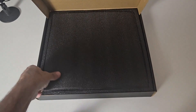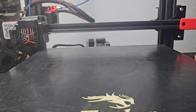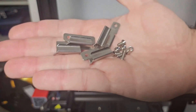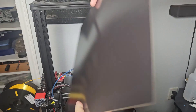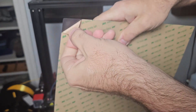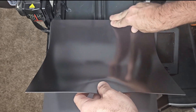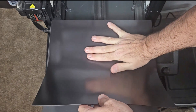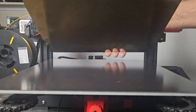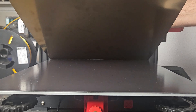This is how I installed mine on my Ender 3 Max Neo. Installation should be relatively the same on any printer you have. First I removed the glass build plate and the hold down clips. Next I removed the backing of the adhesive on the magnet base. Then I put the magnet base in place — you will want to start at one side and make sure it is on straight. Then you just put the metal PEI coated plate in place.